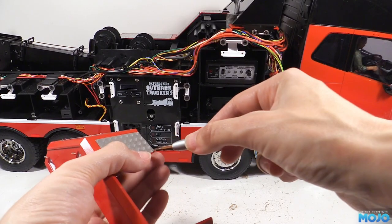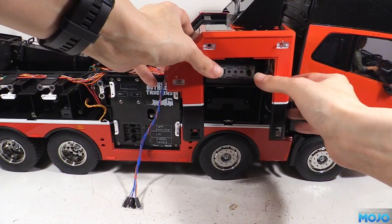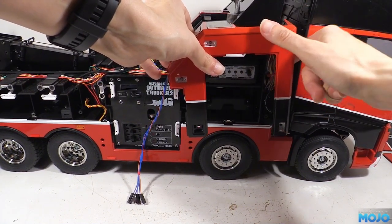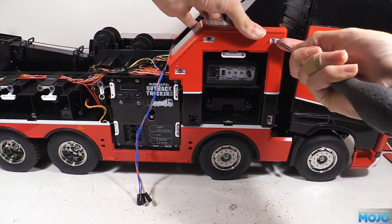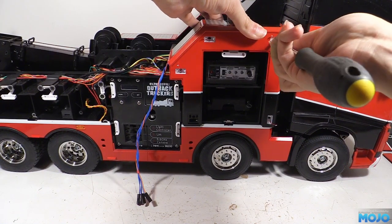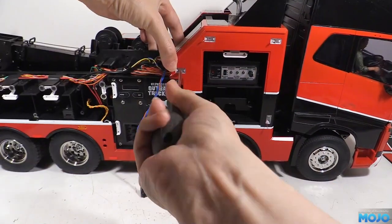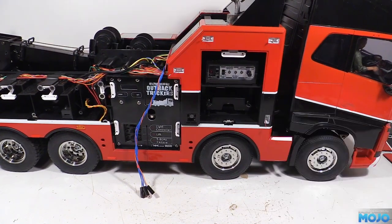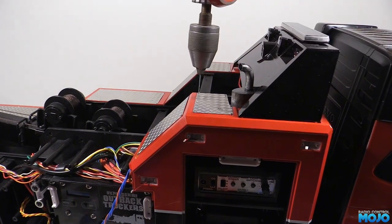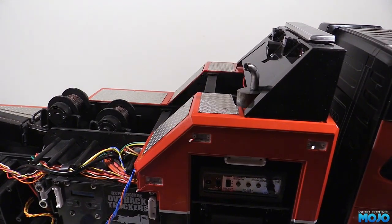To fix the screw clearance problem, we need to remove the screws near the edge before offering up the panel to the chassis. There's a lot of wires in there now, so we need to take care not to pinch anything. I've tapped all the mounting holes with an M3 tap, so we can use M3 nylon screws instead of the metal ones, mainly so we don't have to worry so much about the LEDs finding a way to short themselves out. Everything around the LEDs is going to be plastic. We need to fit a couple of the screws now to keep the panel in just the right spot, then we can run a 0.75mm drill bit through the holes for the plates into the edge of the plastic on the chassis. We only need to go 2 or 3mm deep, as there's not much of the screws sticking out.